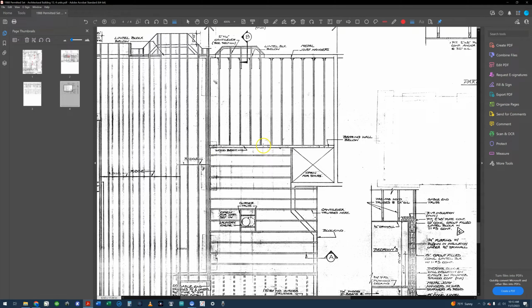There should not be any bearing on that partition between the kitchen, the living room, or the kitchen and the staircase. So I don't really see how there's any bowing in the wall. The only thing I can think of is maybe, did the builder or the framer, when he framed it out, not extend this beam from this concrete block wall to this concrete block, they call it like a cheek wall where it comes off.